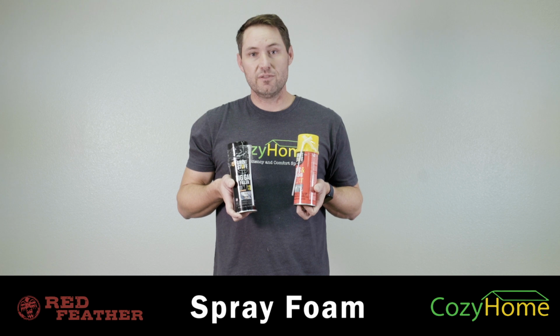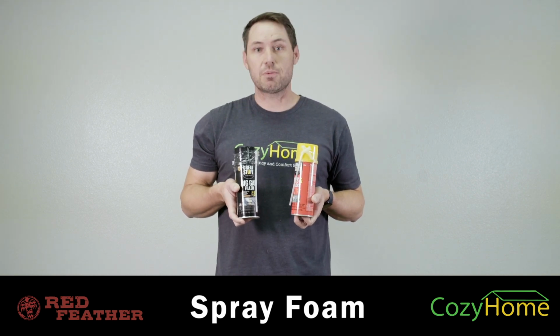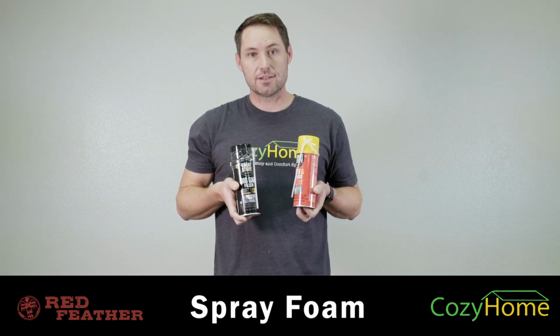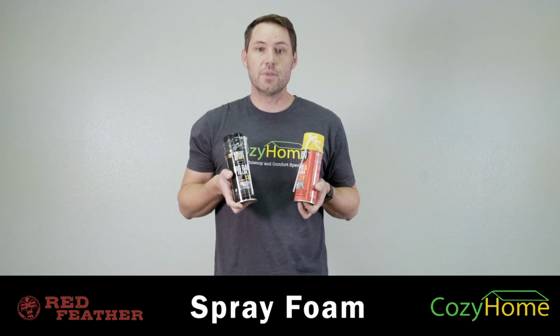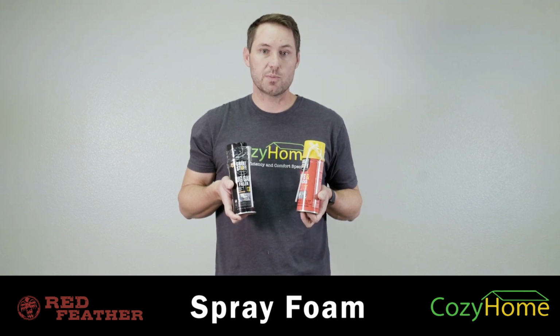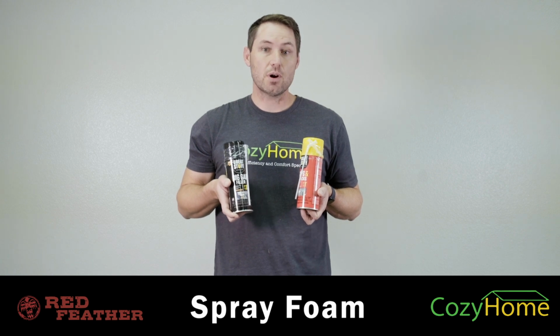So if you have a couch underneath this, when you're using it, move the couch away from the wall, maybe put down some drop cloths, things like that, because this does drip sometimes when it expands. So you want to make sure you're very careful of what's around you. If it does get on something that you don't want, the best way to clean it up is to spray it with water. Use a little spray bottle and spray it with water. The water helps accelerate the curing process for it.